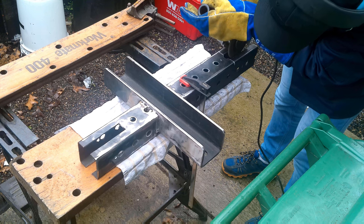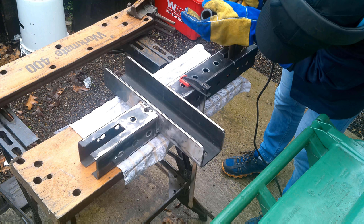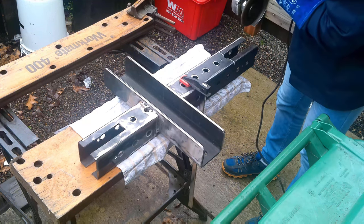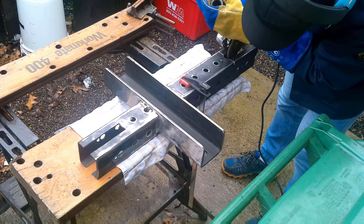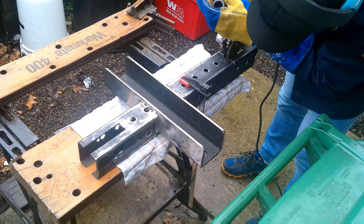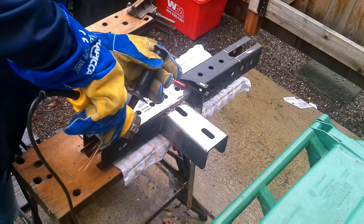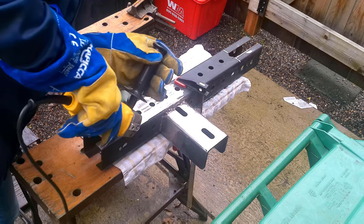Next, because I wanted to smooth out and not have any sharp metal on the inside, I took that same sanding tiger paw that we used before to remove the paint and smooth out the edges. After that, there were still some metal shavings underneath the bottom of the lip that I wanted to get out. So I took a grinding bit on the Dremel and made it all smooth.